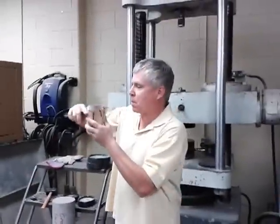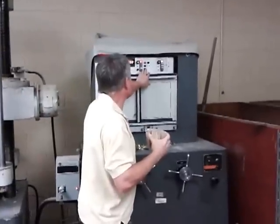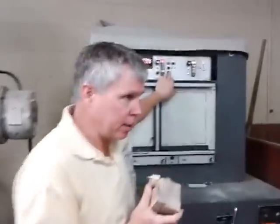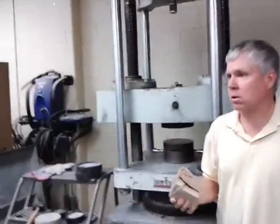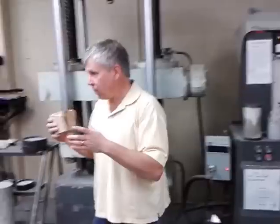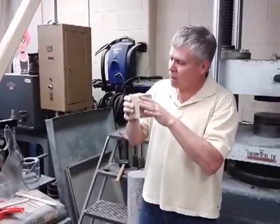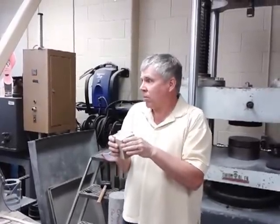So there's my shear plane. I was expecting this angle. What is the ratio of the areas? Was it 94% or 90%? Okay, this tells me I'm going to be about 800,000. That tells me I can test it. I tested this little one to give me an indication of what the other one should be doing. If this number here was, say, 575,000, I'm not testing it. I'm using this as an indication of where I'm going with the next one.